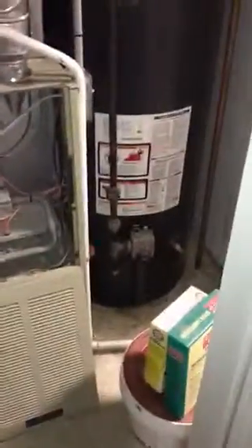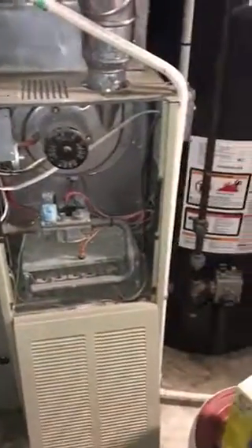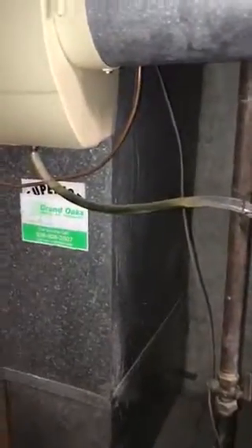I'll give you guys one more view of everything we're looking at. We're going to reuse the existing return. I'll have to adapt the plenum a little bit to get this in here — it's a tight fit. Here's the condensate line running down, there's a floor drain right there. If you could redo that condensate to get that trap out of there too, so it drains properly and won't have that clog spot. Alright, appreciate it guys, thanks.